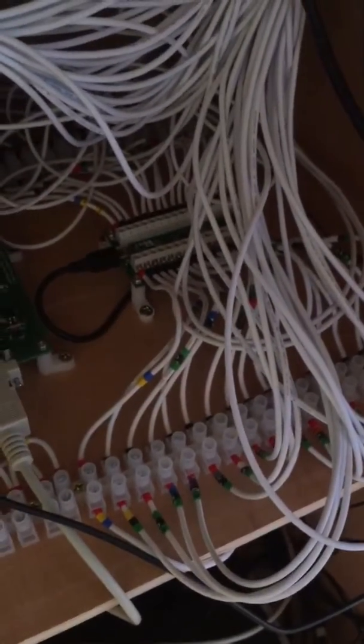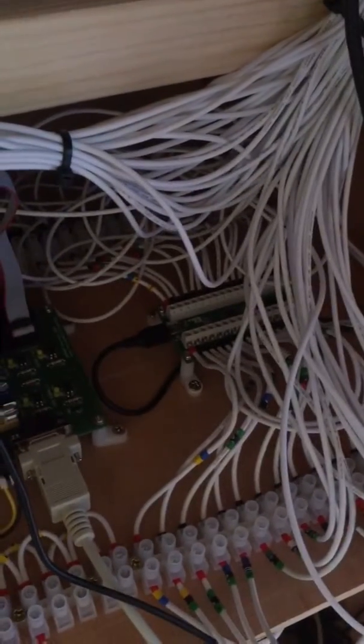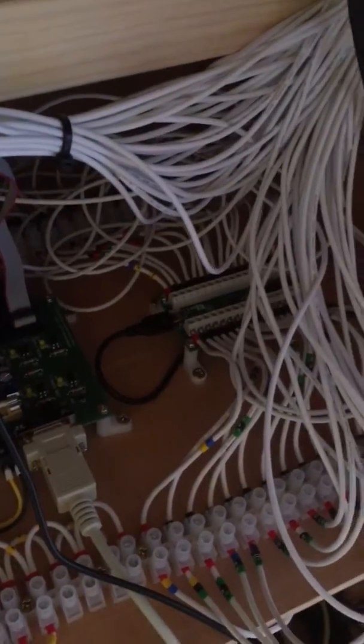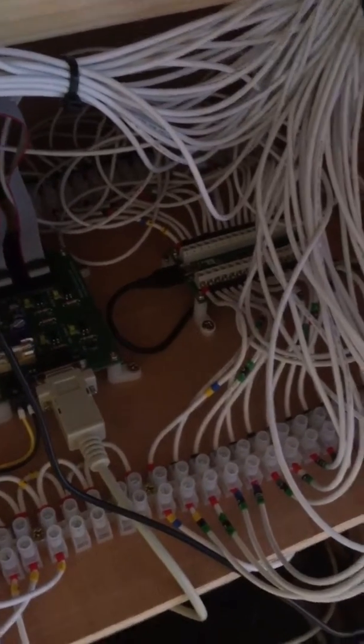And then moving along on the control board, right at the end over there is the iPac. So that's the thing that takes, I think they call it a keyboard encoder, but basically that takes the buttons in and converts them, because it's connected by that USB at the end down to the PC. It converts them to actual key presses. So you can just have a common coming out of there to one side of a button. You press the button and that goes back to an input, and then on some software that you run, you basically say, when that input comes on, what key do I want to press? Okay.